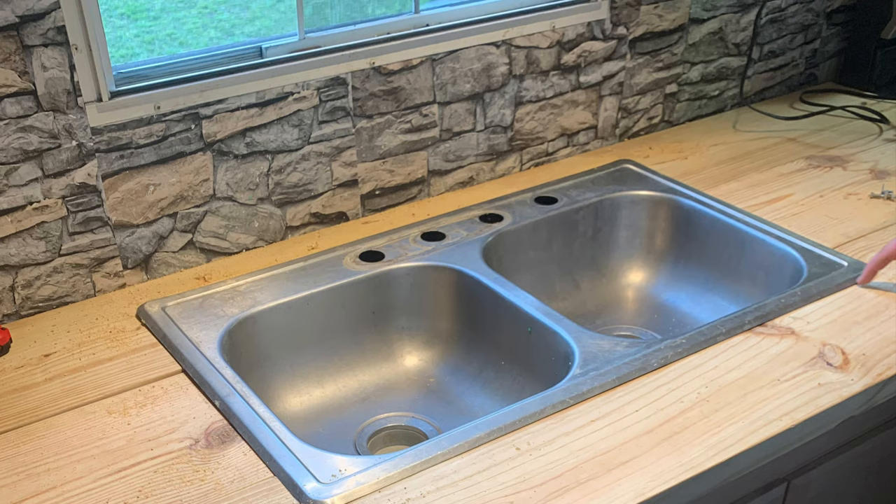These are the small pieces of wood I was telling you about that we used to brace the kitchen countertops. I opened up the cabinet doors and stuck the piece of wood underneath the countertop and screwed them in, just so the three pieces of 2x10 wouldn't be budging or sliding out from each other.